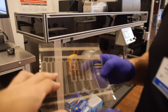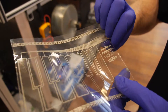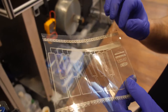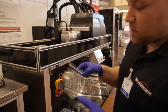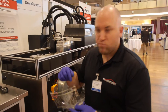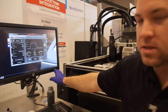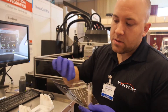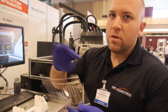This would be connected to some kind of electronics. You have a connector here called a ZIF — a very small connector — and a small device that interprets the signals. You need a little microcontroller, but it's very cheap and common. The application for this kind of device would be a switch — on TVs, lamps, anything at home with little buttons. Instead of a physical contact switch, you just make a small change in capacitance, which gives you a much cheaper switch with absolutely no wear and tear since there are no moving parts.